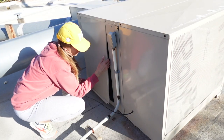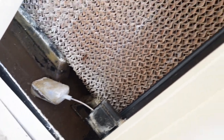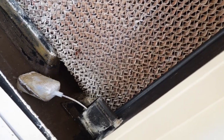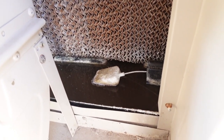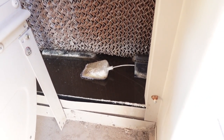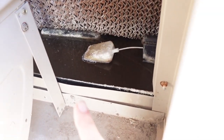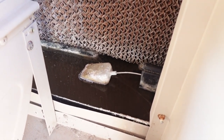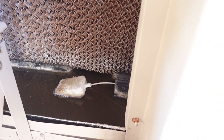Now I'm going to open up the side of the unit. It's pretty dank in here — this unit's kind of old, and you can see the filter there. I can't even get it off; it's really crusted with a lot of minerals. There's a dish of water there. If you don't drain the water, it can grow mildew, and then when you turn the unit back on in the spring it smells like mold and swampy — hence the term swamp cooler. So there is a little plug inside that dish of pretty awful looking water that I'm going to reach in and try to find.